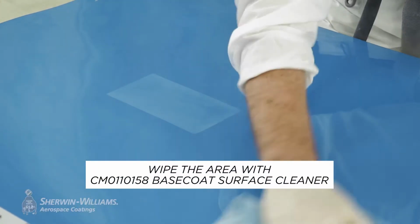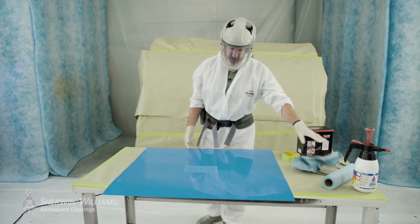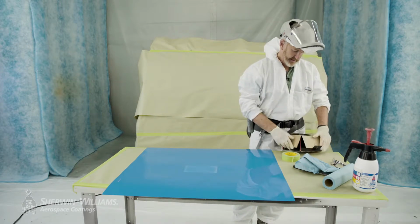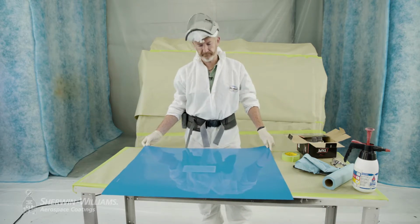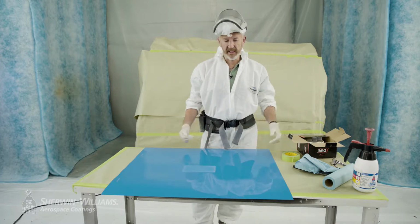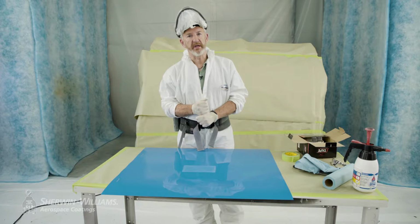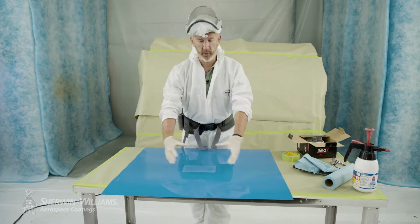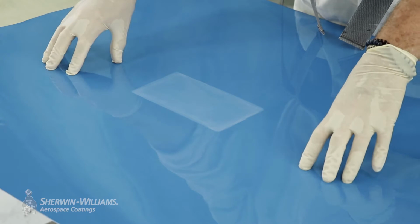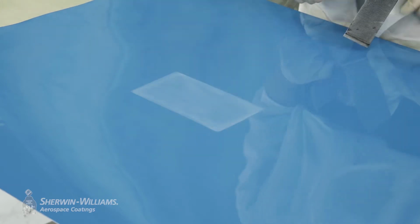We'll let this evaporate for a few seconds. Make sure the area is dry, and then we're going to start our masking sequence. Again, we're going to use a soft face material today. And the idea is, certainly on GAs, there may not be a seam, there may not be some localized area that you can break line. In many cases, it's easier to actually sand to a seam and re-clear. But where there's no area, possibly the environment isn't painter friendly. It could be an MRO shop where you're doing a very small area. This can be to scale, any scale, but the principle is to repair an aged clear with a very acceptable finish and result around the edge of the area.